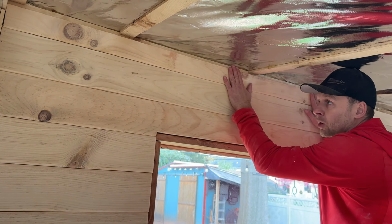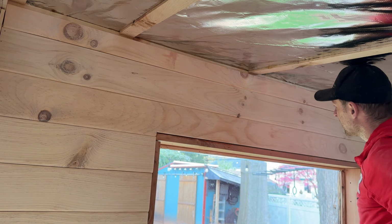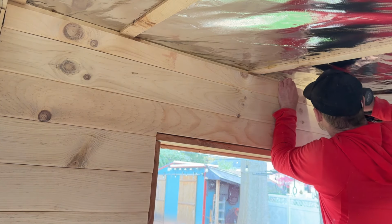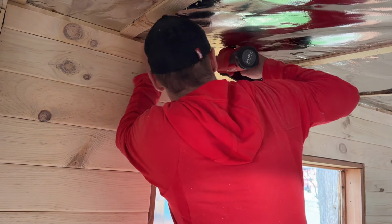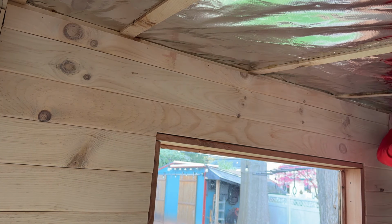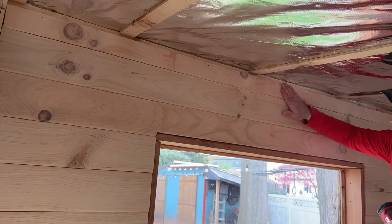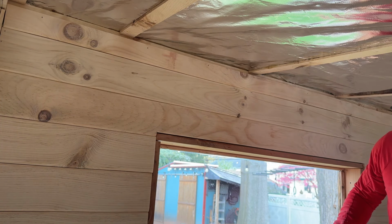And ceiling will hold this in place, but you can still staple it down or screw it down. Since I have my beam there, I can go directly into the wall. Now I don't need the angle. Those nails will be covered when we put our ceiling beams, so we'll be fine. So this wall is basically set.